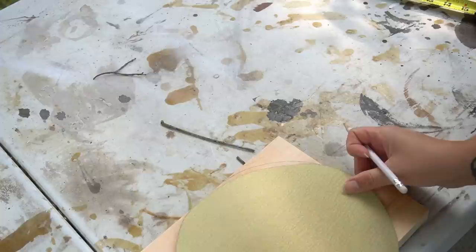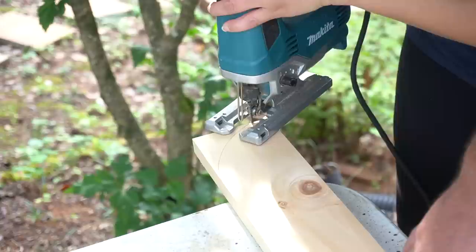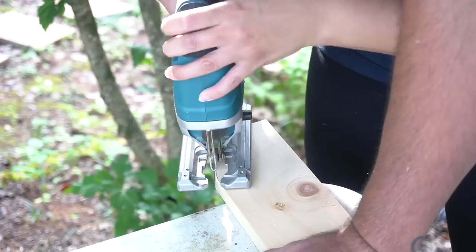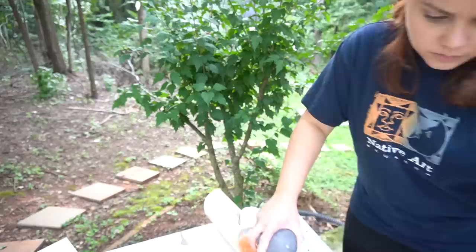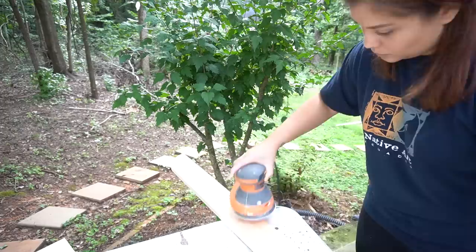There was a second thing where I kind of deviated from the plans. I didn't want a sharp edge at the very top — I wanted to taper it. So I made sure to mark where the back support was going to be, and then with a sanding disc I traced the edge to cut that piece off and make it a little more rounded and custom at the top. I used a jigsaw to cut this out. Then after all the pieces were cut, I gave everything a nice sanding, making sure there were no splinters and also evening out the wood tones. Since a few of the boards were a little older, we did end up buying one at Home Depot, and sanding them down made the old ones look brand new again.